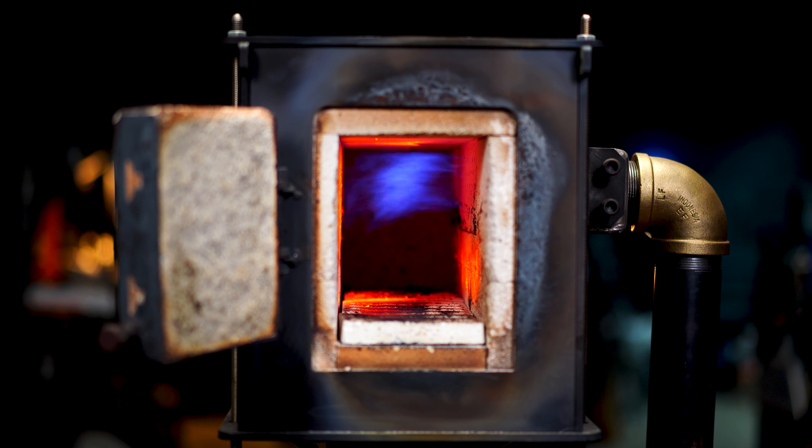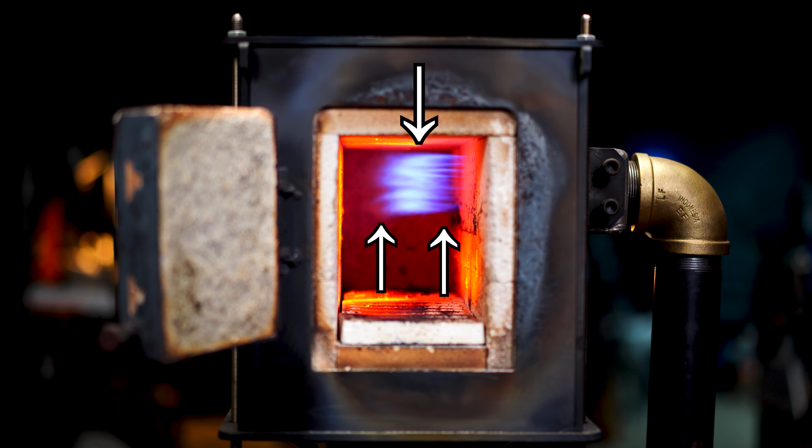About a quarter turn on the needle valve — look at the difference in the flame. Opening it up again a little, you can see the difference in colors coming out of the burner: light blue in the middle of those cones, and blue and purple all around. Turning the air down a little more — you can see this in real time. About right there — now I'll turn the propane down a little more.